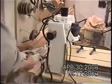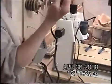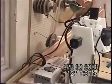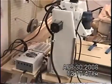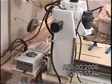This is the control box for the thing. And guess what? It takes little chips like out of your cameras, out of your video cameras or whatever. That's what the program is stored into in that thing. You can actually download off the computer into that chip, and if you wanted to, you could save each one of them on a chip and keep putting them away. That way, the next time you wanted to run that same thing, rather than have to download it from the computer, come over, plug the chip in, tell the computer run from the chip, and it runs that program, whatever one you had in the thing.